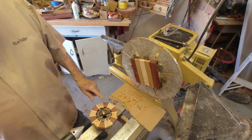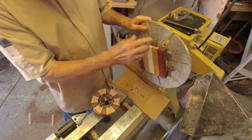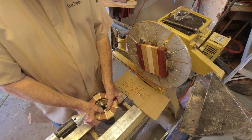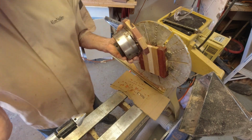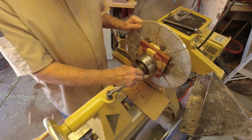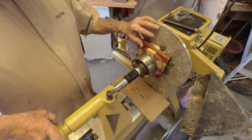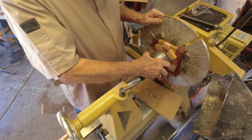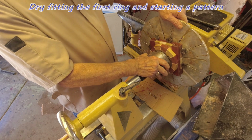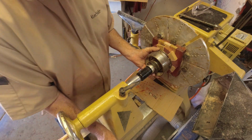For the alignment on this right here, my first board, I'm going to see how close I can come to getting it aligned on one of these here, whether it's in the middle of this or whether it's on both outsides of it, however it goes. But I'm using the jaws of the chuck to secure my piece. My piece is taller than what the tops of these jaws are. I've expanded the jaws out to hold it, and then I'm going to do a dry fit. The reason I like this is because this hole here is made for this doggone live center, and with having it locked down, this is how I apply my glue, my force, my tension, and so on. So I'm just going to do a little test fit here. I could put it like this, insert right in the dead center of that guy right there. See how it is over here. It's not quite dead center. So I like that. That there will be a nice little design feature. Nobody will notice it, but I do.